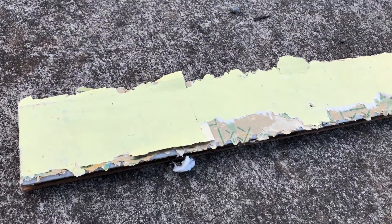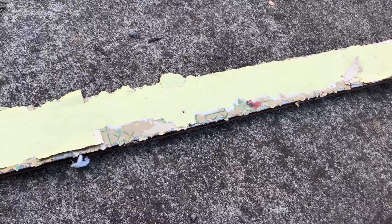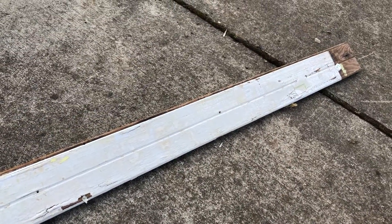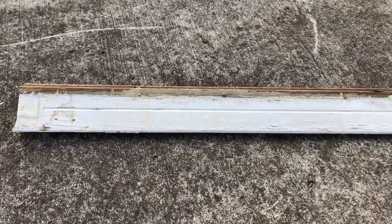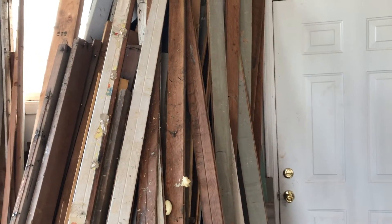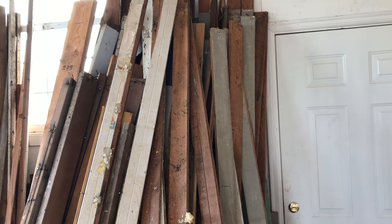The tongue and groove that came out of the bathroom was completely coated with wallpaper. What I did was set a bunch of them out on the driveway in the rain for about two days, then set them up on the trailer and just took a scraper — the wallpaper just scraped right off. It had softened the glue and I put the old wallpaper and glue in the trailer for the dump, leaving me with clean boards. Unfortunately there are still boards attached to the wall that we'll have to spray with water to clean off. A lot of these reclaimed boards are 10 feet long and I have quite a stack, but the question is whether I'll have enough to redo all the parts in the kitchen that are going to show.